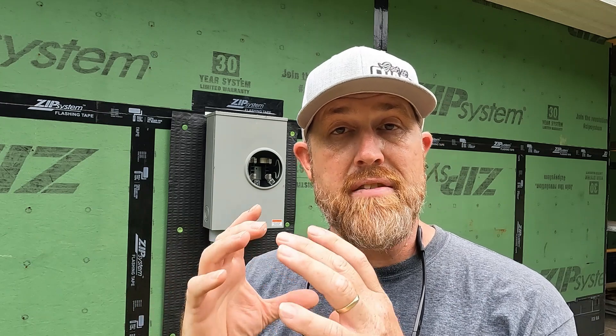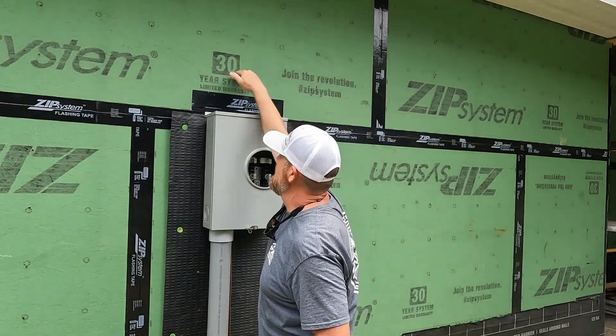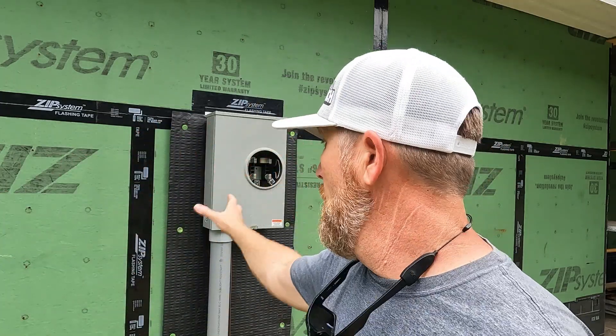That is a very vulnerable spot where water can get in around that pipe, and I think nobody really thinks about it. Here in Tennessee we get some blowing rain, so it can definitely blow water in, come down, run down on top of that rigid coupling nipple, get into your OSB and rot it. It may be 15 years and the whole thing is barely hanging on by a thread. So we don't want that to happen — I'm going to show you today how to flash it properly.